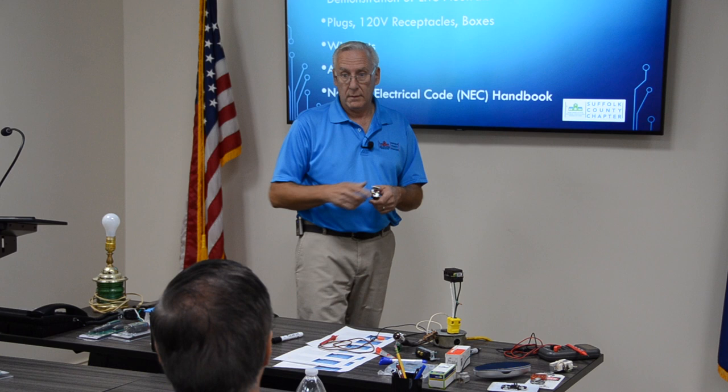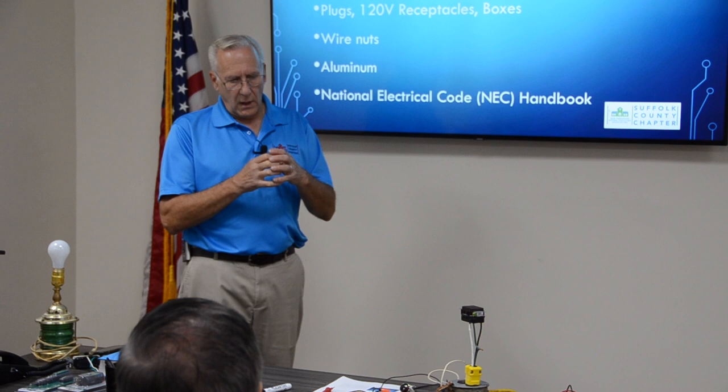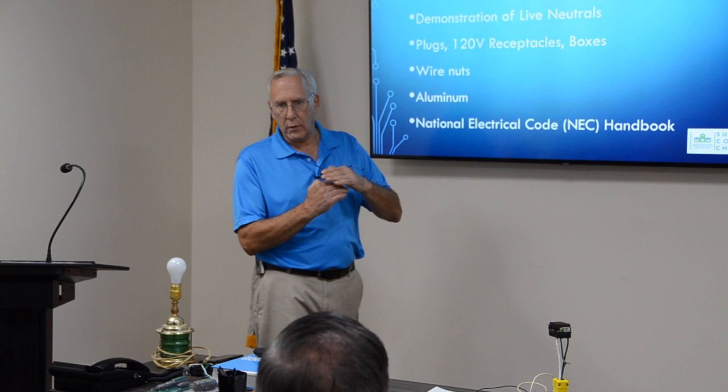There is no cure for it. Why is it so bad? It's the coefficient of expansion of aluminum. Copper, aluminum, at low voltages, which is 120 volts, it expands and contracts so much on the load. You plug the coffee pot in, you take it out. Plug it in, you take it out. It keeps doing this all the time, and it loosens up the screws because it's high current, low voltage, maybe 10 amps. The coefficient of expansion.